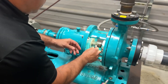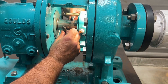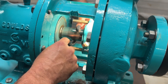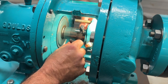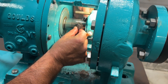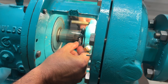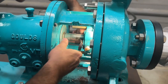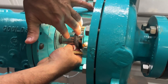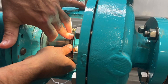Now I have my first packing ring set. I'm going to pull it in and do what's called the helix. As you're installing the packing, I have one of the cuts sloping away from the stuffing box and one towards the stuffing box. I always want to do the one that's away first and seat that in. You never want to reverse it and seat the one pointing towards the stuffing box in first — because when you close it inside the stuffing box, you end up with a little step. A little trick: if I'm having a hard time getting my packing in, I'll take the free end and bend it back a little bit — that'll drop that top edge right in.